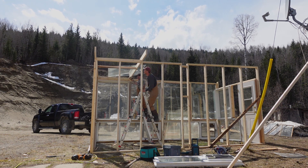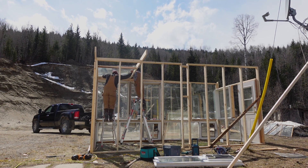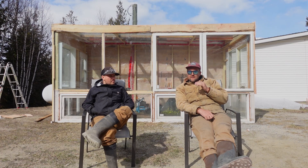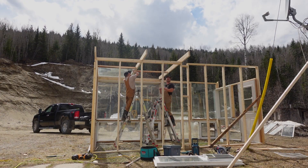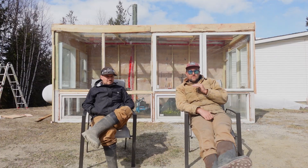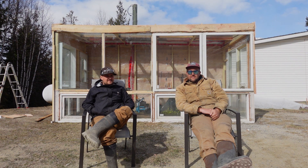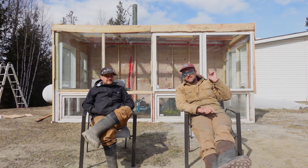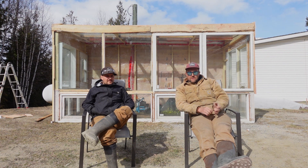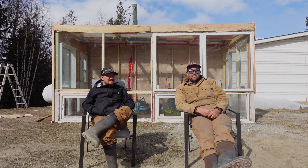There's no way those panels will be able to stand up to the three to four feet of snow we get here. If you're going to try and keep the greenhouse together all winter, at least two-by-eights — I'd almost suggest two-by-tens for your roof — and make sure they're protected from the weather. For us, we went with two-by-sixes knowing we're going to be taking out the window panes on the ceiling during the fall when we winterize.